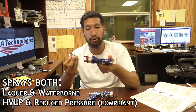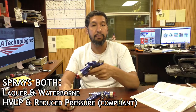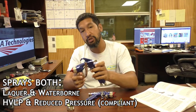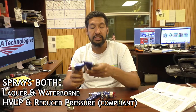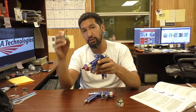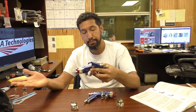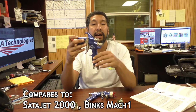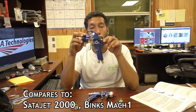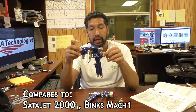That's one thing that CA Technologies has a leg up on — they ship a lot of their guns to be able to spray both ways. A lot of people are very familiar and comfortable spraying HVLP. If you've ever considered making a switch over to compliant, the CA line is a great line to do that, because you can keep spraying HVLP like you always have and then move over to compliant once you're feeling comfortable — do some test sprays and then officially switch air caps when that time comes.